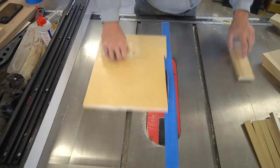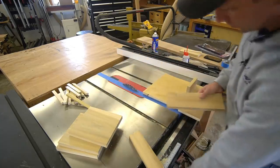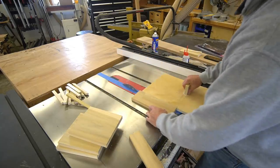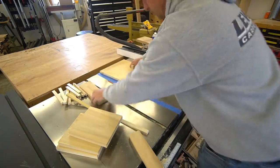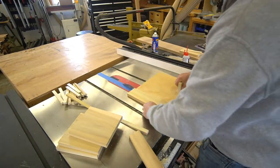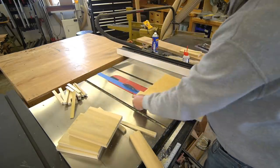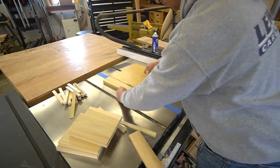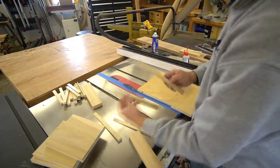For this project, I wanted to have a blunt end on the end of my shims. In general, most guys prefer to have a very thin tapered point on their shims. It's really easy using this jig — all you have to do is make the block of wood longer, and that will allow you to get down to that extremely fine tapered point.